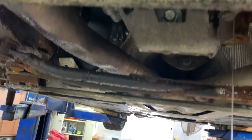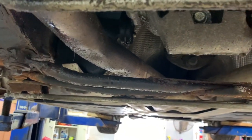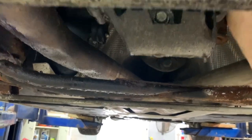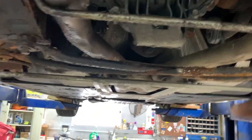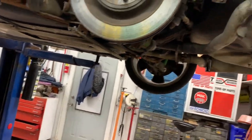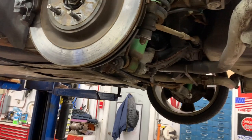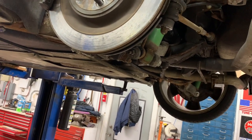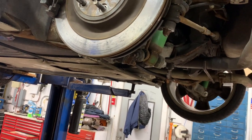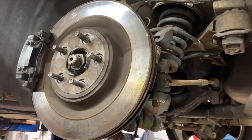The level is supposed to be about an eighth to a quarter inch below the fill hole — that's fine. Put the plug back in, tighten it with your ratchet, and clean off the area so it doesn't look like it's still leaking. Put your tire on, lower it back down to the ground, and torque the lug nuts to 100 foot-pounds. That completes your rear differential half shaft axle seal, knuckle, and bearing repair. If this helped you out, please subscribe — I appreciate it!